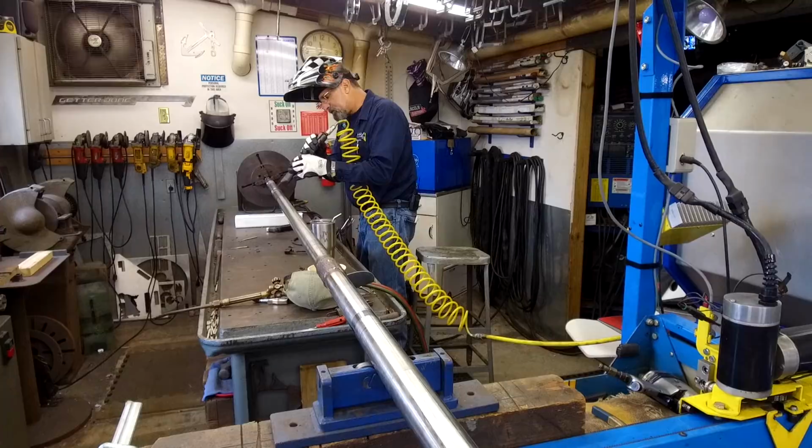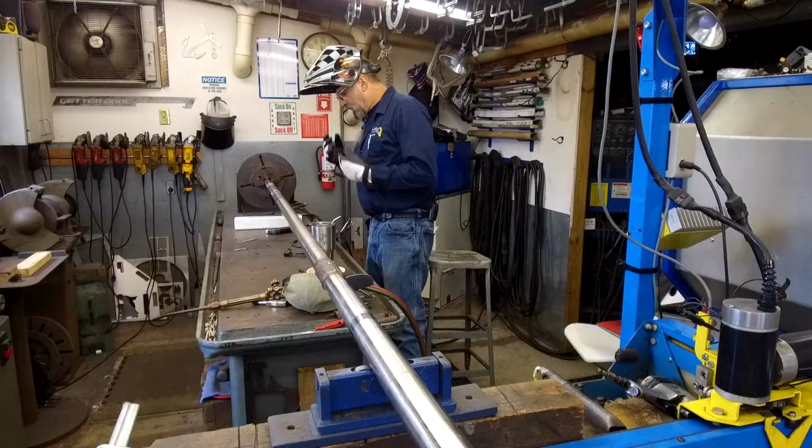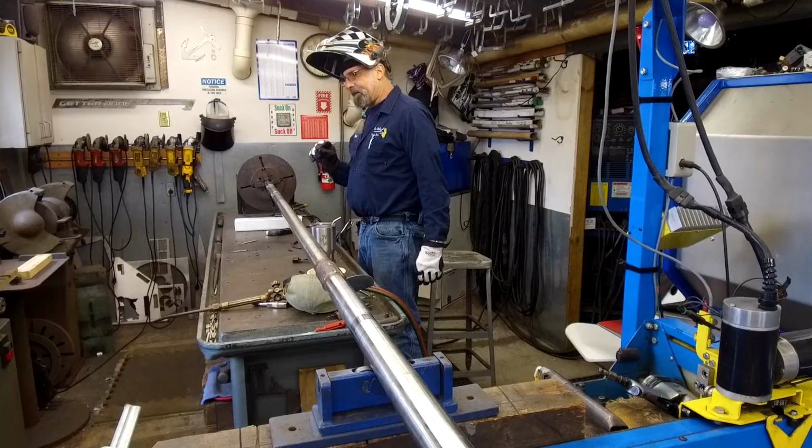Okay, it's raised up a little bit, but when I make my lineal beads there, I'll know that we're not going to be shy of any material. We're not going to be dipping into a groove there, which I don't mind if it's a little fat in the center. In fact, sometimes you actually sag a little bit in the center because you got such a long stretch. Sometimes you're racing across there a little bit, and you tend to get skinny on your bead in the middle. At least it does on me.